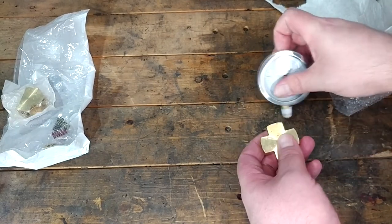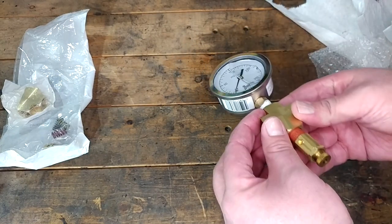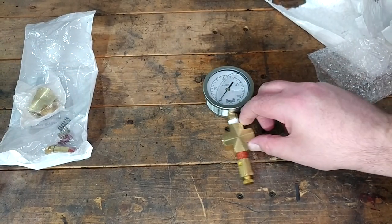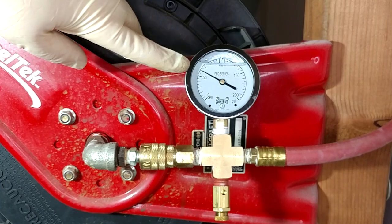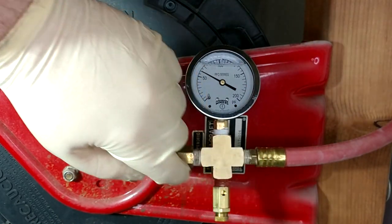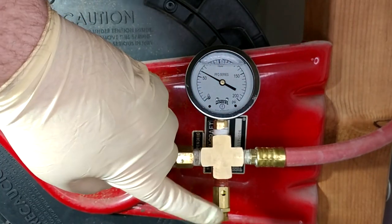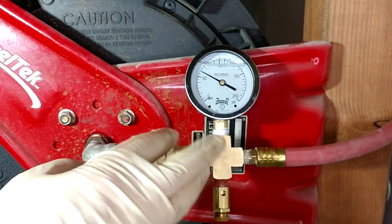I'm going to put that guy on one end, put that guy on the other end, and my hose reel is already on quick disconnects so there'll be air fittings on each side of this thing. This thing's kind of sharp — I think I'm going to take to that with a file. All this stuff will be linked in the description. These are Anderson Metals Made in USA solid bar stock billet brass — they're nice fittings, but they are a little sharp. So now I've got a pressure gauge here, my overpressure blow-off safety is here, there's still one on the tank and eventually there will be two. This is on a quick disconnect and this hose is also on a quick disconnect. So when the time comes I can just unhook this from the reel, unhook this from the compressor, take this whole thing somewhere else, and adjust my pressure to get this to pop where I want it to. And almost as importantly, I now have a pressure gauge that works and that I can readily see.